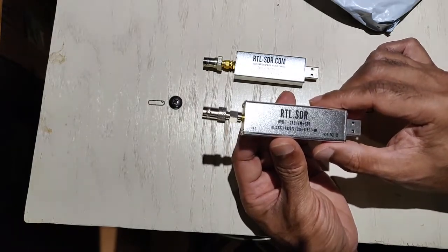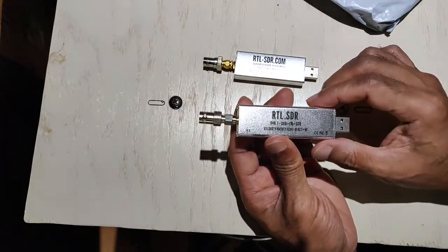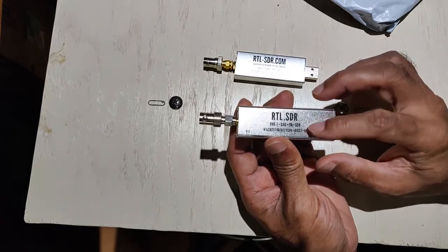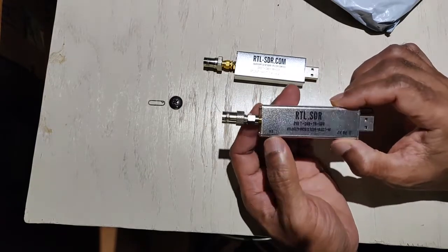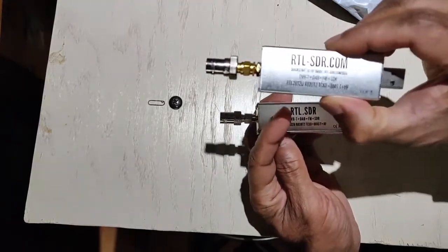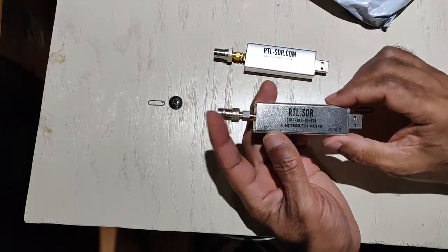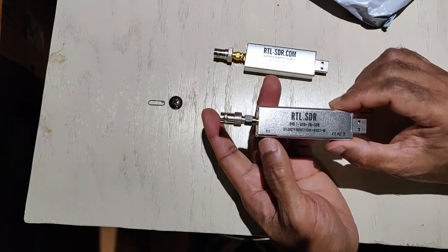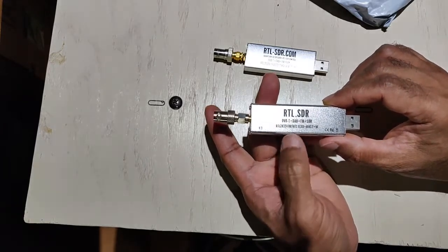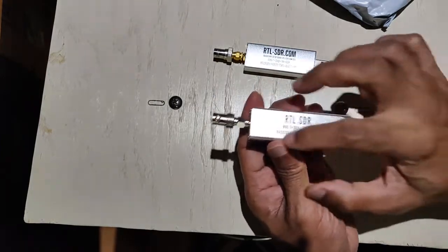So the original works correctly while on the clone I need to adjust the PPM clock level to receive that signal. That is an indication there is no real TCXO — the TCXO claim is wrong and incorrect. That's number one. Number two, later in the video you will see that when I go to HF there is no signal heard at all. The direct sampling in this clone does not work, although it says version 3. They have just copied the label — version 3 is supposed to work on direct sampling for HF below about 25 MHz, but it does not.